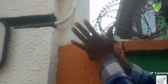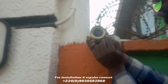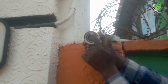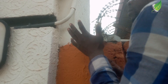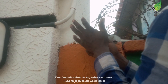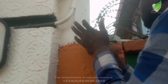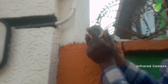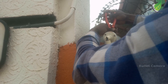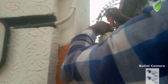I'm going to cover this camera now and open up the sensors, because these bulbs around the camera are supposed to display light each time I cover the camera, since it is sensitive to light. If I cover it up this way it senses that there's darkness around and the light will come on. But you can see this camera — no light is coming on, which means there is a problem somewhere. Either the camera is bad or power is not coming to the camera.